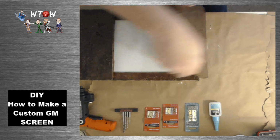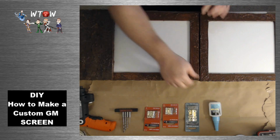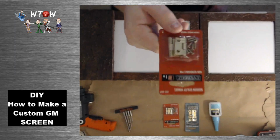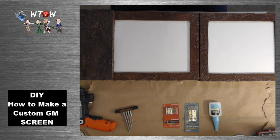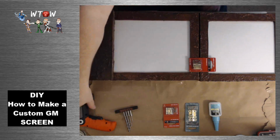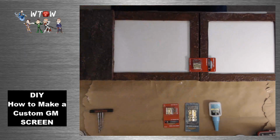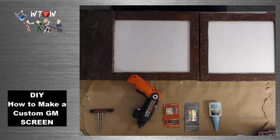All right. So you'll see here that I'm making sure that the match panel just flips out to where it needs to be. And I'm going to use these little inexpensive, cheap brass covered hinges to come back across each one of these. Now, just like I did earlier when I put the screws in, I don't want to have anything split, especially now that I've got some acrylic laid down on top of this, which is what that Mod Podge and paint is. It's acrylic based. Lay out your hinges where you want them. Make sure that you get them lined up properly.